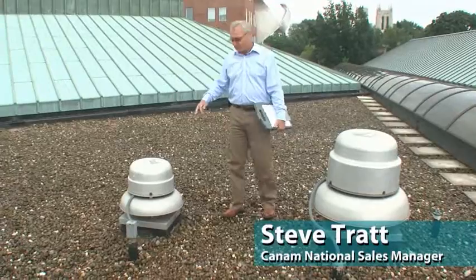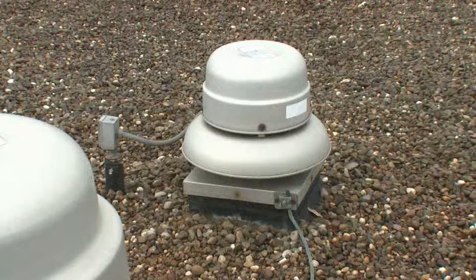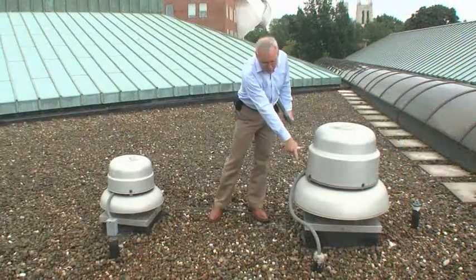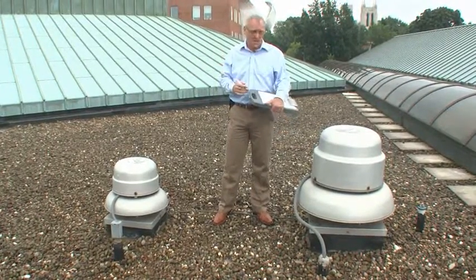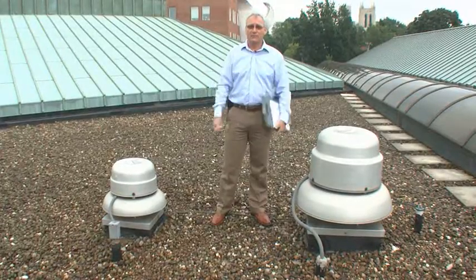We're up on the top of the roof and we've determined that on this roof line we have two roof exhausts. We have approximately a 1x1 roof exhaust — it could be for a bathroom or a kitchen area that's exhausting — and a 2x2. From here, we're going to scan the rest of the roof, determine how many we have, the sizes, and we will equate a crack size at the top of the building.